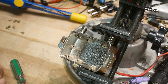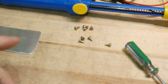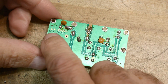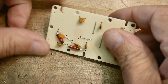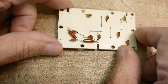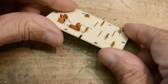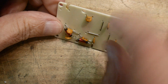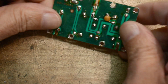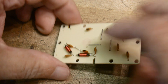Let's take a look at it. We've seen this side — it is a U2120005. And on this side we've got some inductors and a lot more capacitors. A single-sided board with some jumpers. So just an LC network. These are marked 2.2, these are marked 1.2, and 502. Maybe we should reverse engineer this thing. Trace it out. Sure, why not.